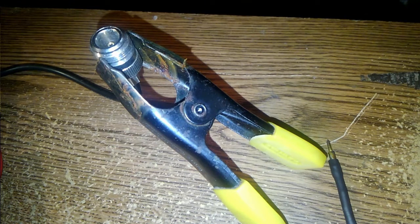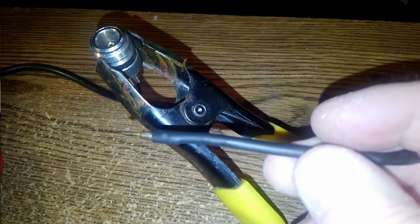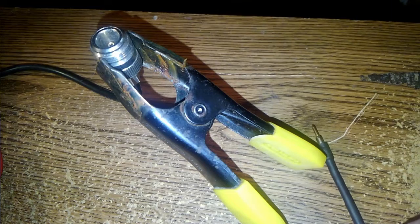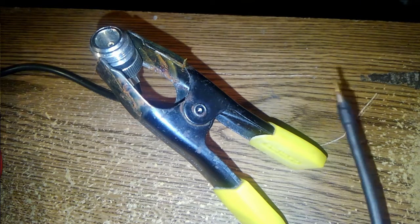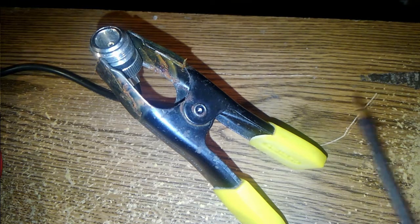I made this 3 inches to account for the additional length of that pin. I would make it about 3 1/8 or a little bit over, maybe 3 1/4, to account for the length of it. If I were going to make it out of just 14 gauge wire with no pin, you should be able to plug that directly into the center pin of the end connector on the pigtail.